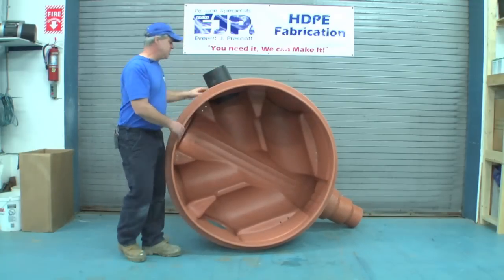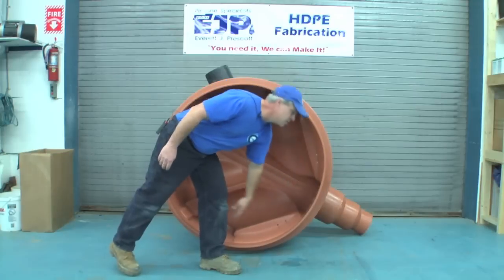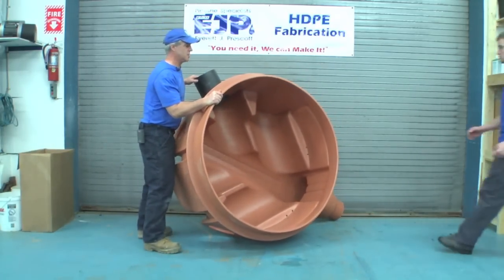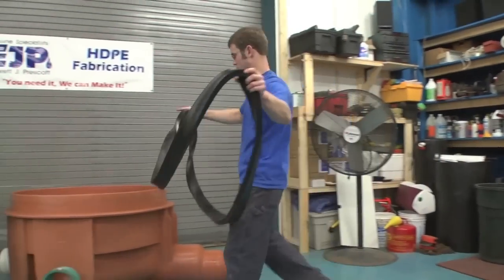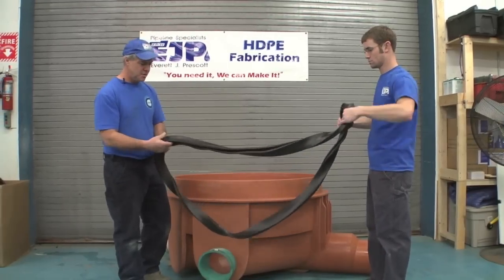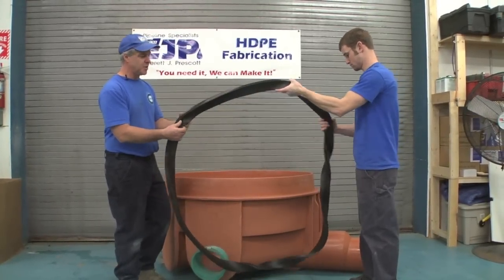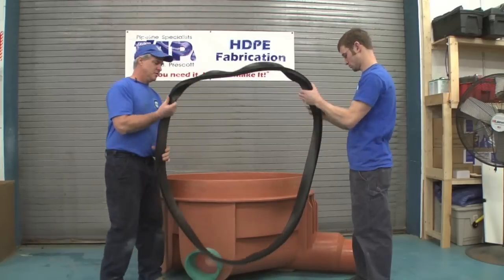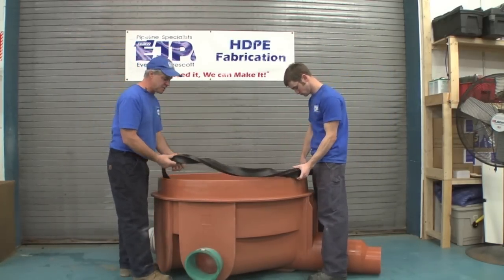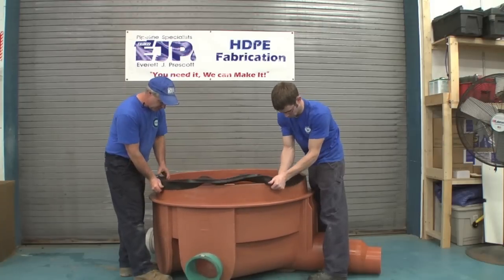This bottom section is 30 inches high overall. It has the lip here for the gasket. This is the four foot foamed section gasket. This gasket is impermeable to water and is also not affected by hydrogen sulfide. The structure itself can be water tested or vacuum tested, and this gasket will hold 20 inches of mercury on a vacuum test.